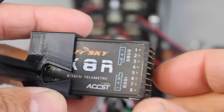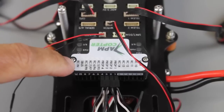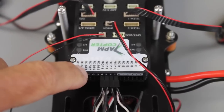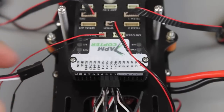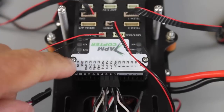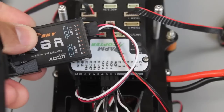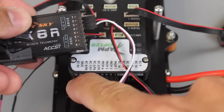The last connections we'll need to make are with our receiver. This is the X8R and I'm using the supplied servo cable that came with the Pixhawk. We'll go ahead and connect our SBUS port here at the bottom. Now what I found tricky with my first Pixhawk install - there's actually an SBUS port on the second pin, but we want to connect SBUS from our X8R to the first port which is labeled RCN. Now we have our X8R from SBUS out to RCN.